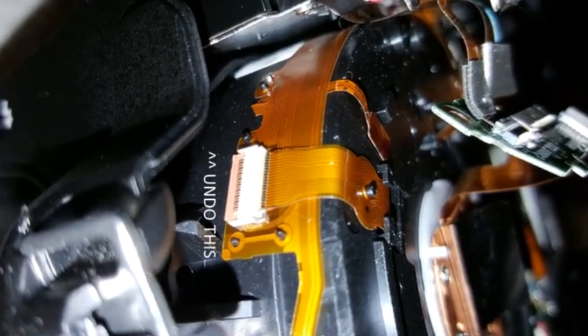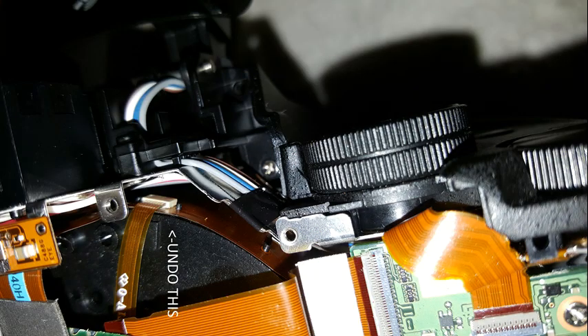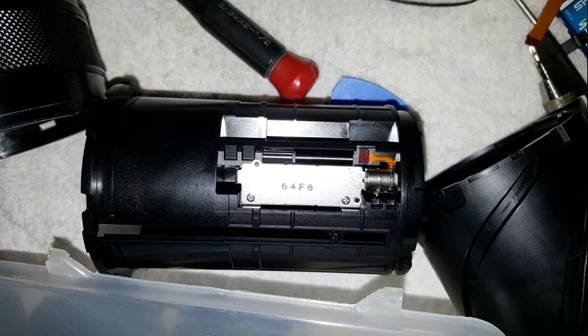The shutter aperture FFC goes over the left side of the lens at 9 o'clock. It is not exactly the same type of connector as the others, so lift the flap on the opposite side to the FFC entry to release it. Free the FFC from the pin in the center so it is free to slide into the lens holder. When both FFCs are loose, you can stand the camera on the lens cap. Remove the three silver screws holding the lens, then very slowly lift the camera and allow the lens to slide down, watching that the FFCs are not broken but can slide into the lens holder. Hopefully you now have the lens body separate with no FFC broken.